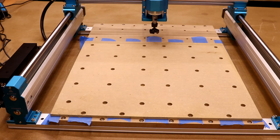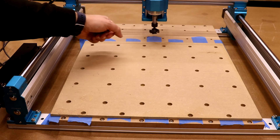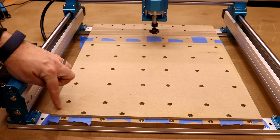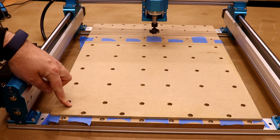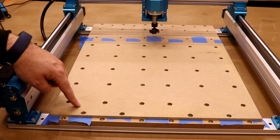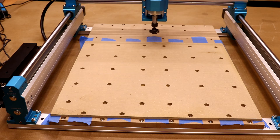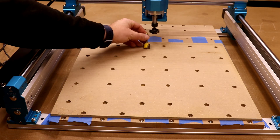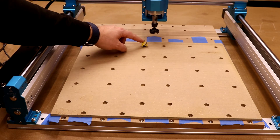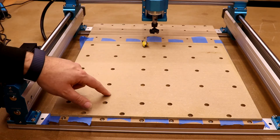I always want to point out my own mistakes. I thought this bit would be OK because of how sharp the blades are, but it was probably too big for this size spindle. There were a couple of chunks taken out very early on — this was user error, not tightening the collet up enough to hold the bit. Then there was another chunk taken out a little bit later on, which left some divots in the bed. So I would probably say use the smaller bits. The big bit I was using is about an inch and a half in diameter, so maybe stick to no more than one inch — about 20 millimetres — and it will just guarantee that the spindle can handle it.